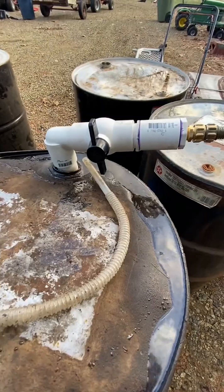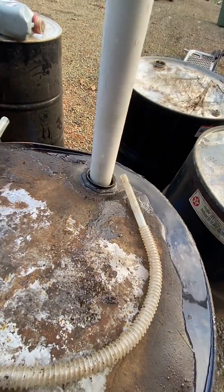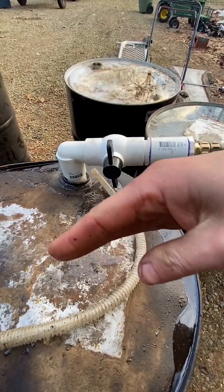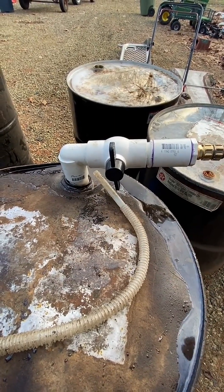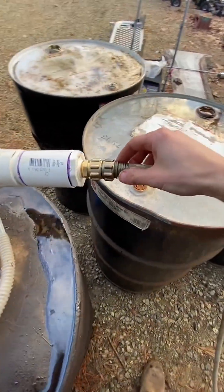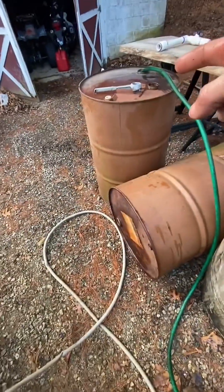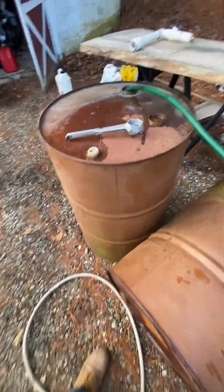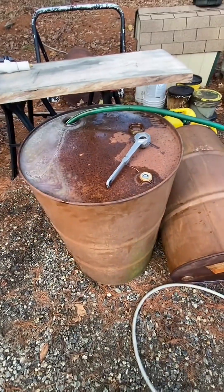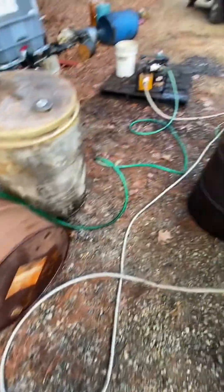What I tested out was the valve setup I made — it's essentially a PVC pipe going into the tank with a 45 degree angle cut on it, so it's not going to just suck the bottom and cause a vacuum. That attaches to the garden hose which then goes to the pump, and then discharges into the other barrel. It's been working pretty good.